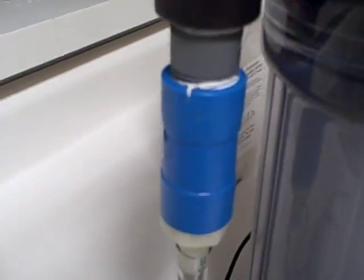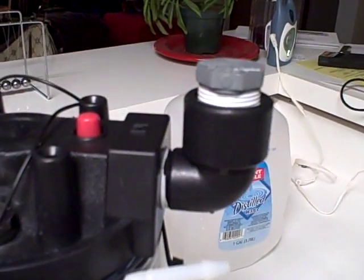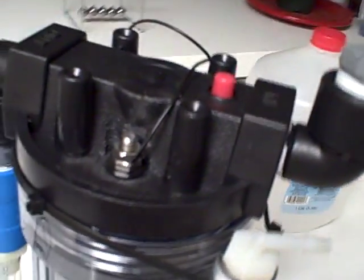What you have is a one-way valve here that goes over to a bubbler, which is attached right to the unit. And that's a fill cap right there. Your terminals are on top. You can't really see inside too well, but I have perforated plates — those are aluminum — in distilled water. It's about one liter of distilled water and a half a teaspoon of potassium hydroxide.